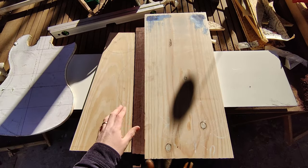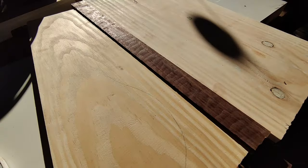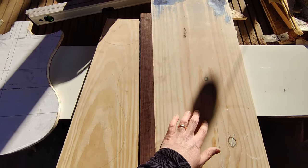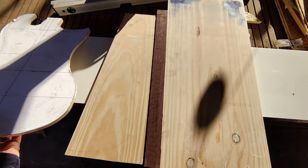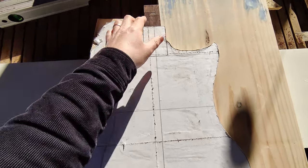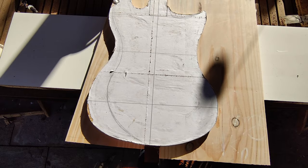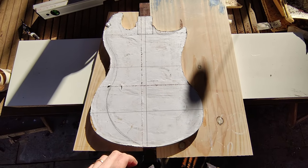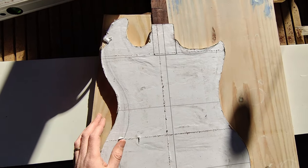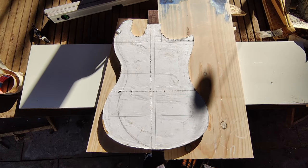I've been busy. I finally got this straightened up — it's a little bit higher than the rest but I can sort that out afterwards. The main thing is the sides are straight enough that I can glue and plane these together. I've decided to swap around where I've got these pieces, and if I put this in the middle — lining it up — as you can see, I avoid all of the knots and that ugly section. I've got enough material for the body, so I'm going to get this glued up.